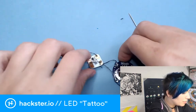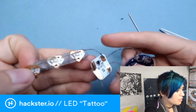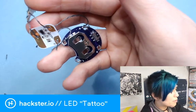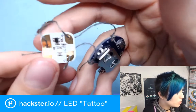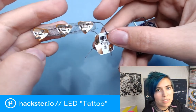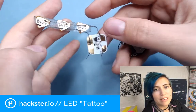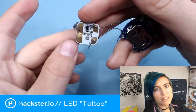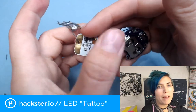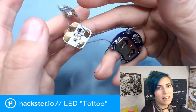So the way this sensor is set up in the Chibitronics kit: you have the coin cell with a positive contact and a negative contact. You wire those up to the positive and negative contacts on the sensor itself. Then the positive contact gets connected to the plus side of your LEDs, and the output from the sensor gets hooked into the ground side of your LEDs. So basically you're putting a really fancy switch — your light sensor, sound sensor, or whatever — as a gate or trigger in your ground line. Your ground lead is interrupted by this sensor, and that controls how much power can flow through.